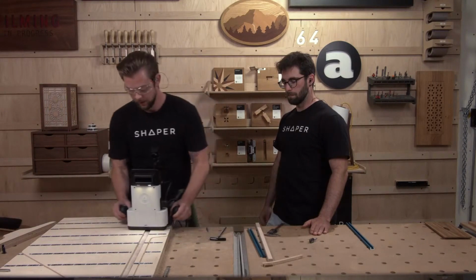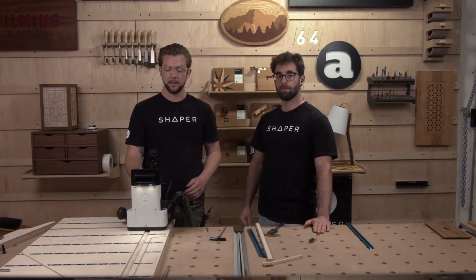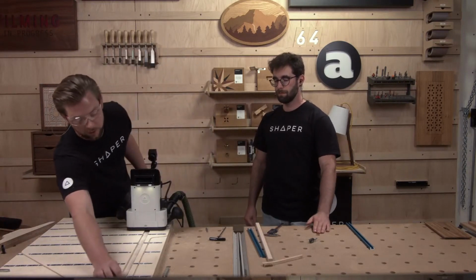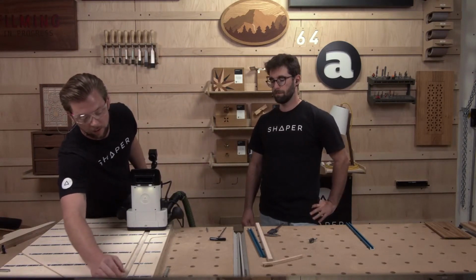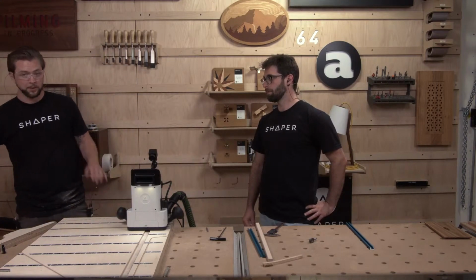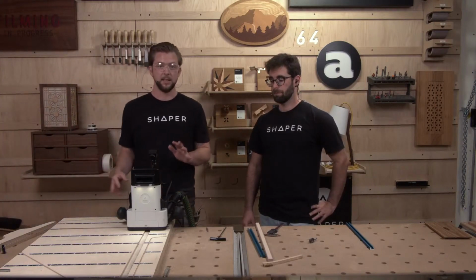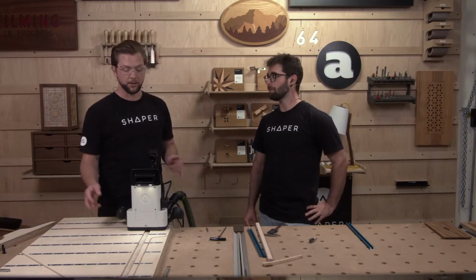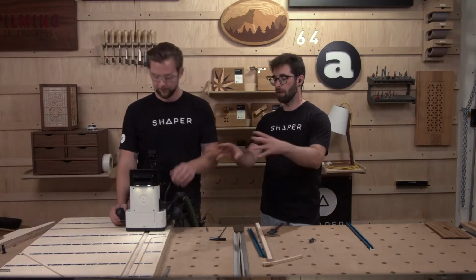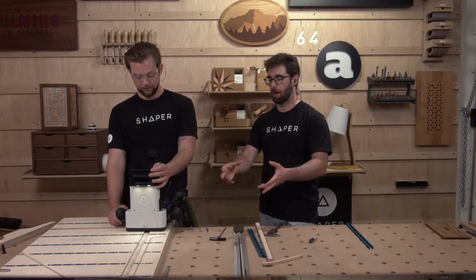All right. Now I'm going to change that to an inside cut. I can still adjust for the fitment of my piece here. But I'm also just going to leave the tape on after I finish this project, just in case I need to edit any one of these features. And we don't need all of this tape because we're going to extract the crosscut sled from the raw stock.